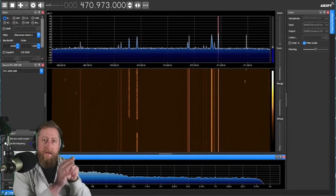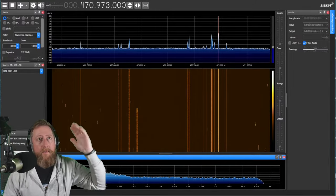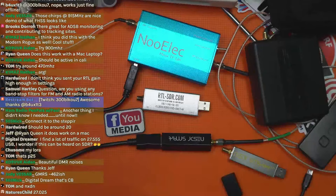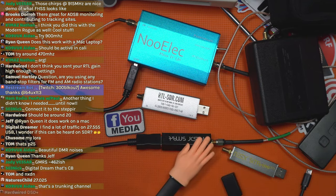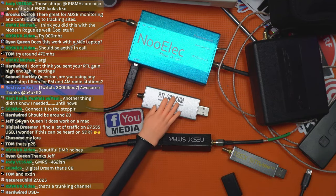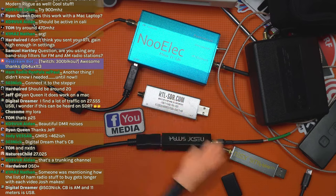So VHF, you just plug it into an antenna. You just take the little stick and you go, hey, I'm doing VHF stuff type frequencies. So 100 megahertz and NXDN. Yep. And POCSAG is up here, which is pagers, all that fun stuff. All right. So repeating myself, so I make sure I cement the message. The sticks, and let me lower this down so I don't deafen myself. There we go. The sticks are SDRs, software-defined radios, right? They do basically 100 megahertz up through 2,000 megahertz-ish, 1.2 to 2,000. So a lot of your VHF, UHF radios, your first responders, POCSAG, pagers, trunking radios, that kind of stuff is what these guys are going to do right out of the box.